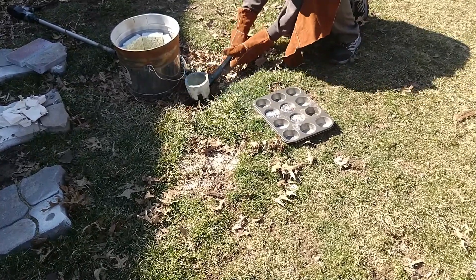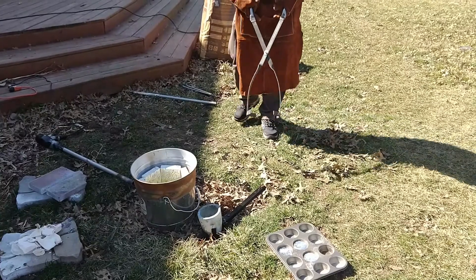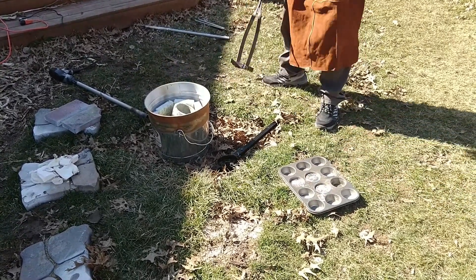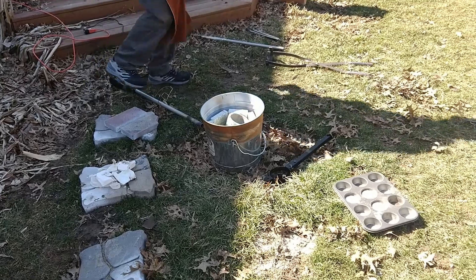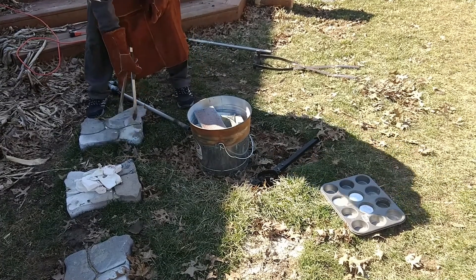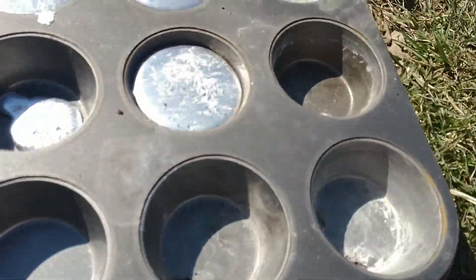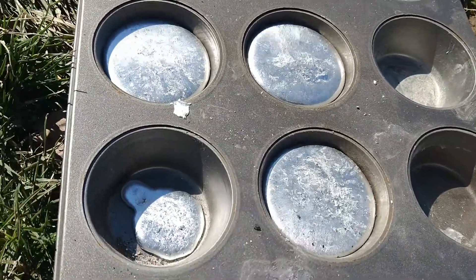Alright. Now we put it down, and then we don't want it to cool off too quickly, because that's bad for the crucible — even though it's been pretty nice to handle. So we just put it back in and close it up. And here's the close-up of the molten zinc, so we can see that if we tap it, it's going to be liquid for a little while.